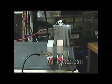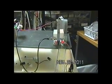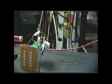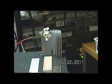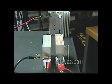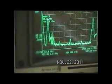So you can see the spacing between the input from the signal generator, and it's again running at 10 megahertz, 1 volt, and we have it coupled via this aluminum block down through this clip lead into this AV plug arrangement. We're not powering, or I'm not even attempting to show these 12 LEDs yet. I want you to grasp the idea of what's going on here. Obviously, like I say, there's going to be a limited few that won't even attempt it. But the coupling between these two is actually driving that SEC 18.